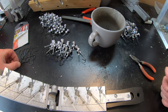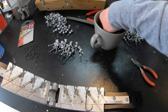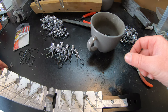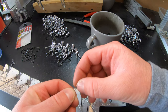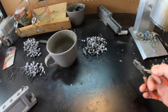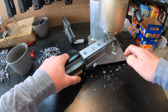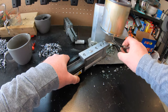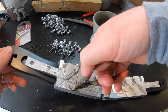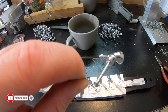This is going to be the final jig I make on camera - I still have maybe 10 or so more to go. Put that hook in the mold, put the base hole pin in, then grab one of our wire keepers and put that in the mold as well, just like so. Close up the mold, come over to the lead pot, pour that lead in, open up the mold, pull out our jig - and that thing looks pretty darn good.